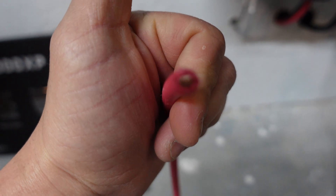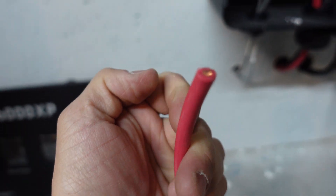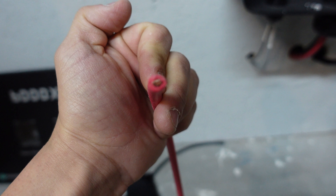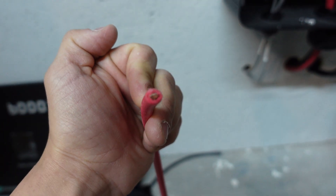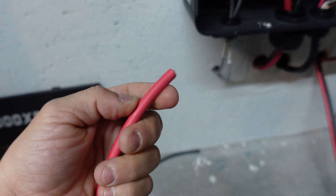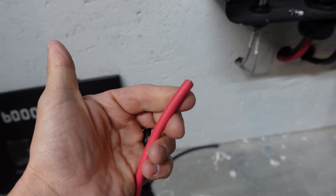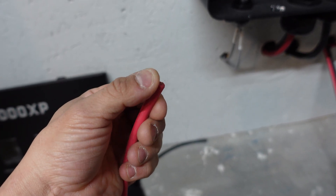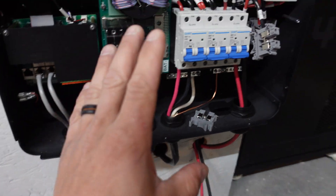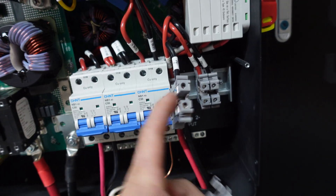The issue is that this is a direct burial wire and the casing is probably double the thickness of normal wire, so the connections just didn't slide over it. I'm going to see if the eight-gauge ones I just purchased will slide over it, or if I'll have to shave down some of the outer casing. Either way, I'm still waiting for Amazon, so let me land the new part, remove the old one, and get these other two lines landed.